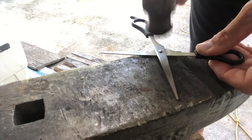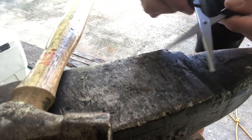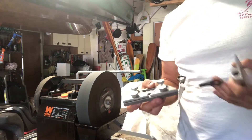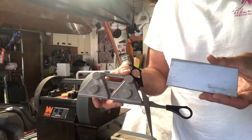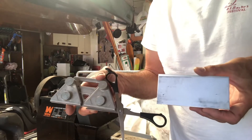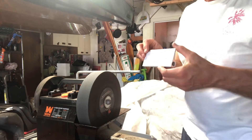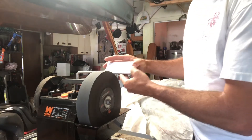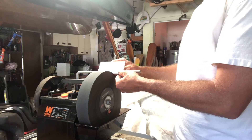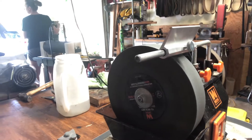I don't want to make it too tight, but it's got to be snug or the scissors won't cut right no matter how sharp they are. The jig I'll be using to sharpen these scissors is a scissor sharpening jig. You get like five or six different jigs in the pack. You use these two pieces in conjunction with each other. The first piece slides on — you'll notice the hole is at the bottom when it slides on, closest to the stone. Tighten the knob right there so it stays.